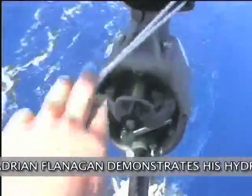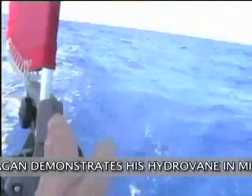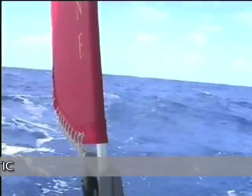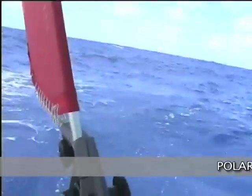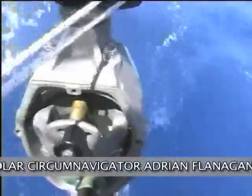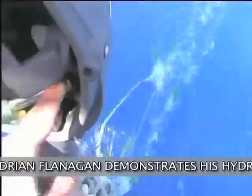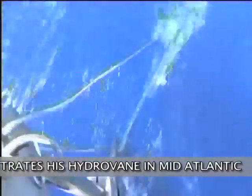This is the control line, and what you do is basically you alter the angle of the vane into the wind in the direction that you want to go, and you set the course, and the vane will be blown either to the right or the left depending on which side the wind is, and as it blows to the right or the left, that movement is transferred to this system here, and this rocks back and forward, and as it rocks back and forward it moves this handle here, which is connected to the rudder, which is down there. That piece of string is in case the rudder comes off, I don't lose it.